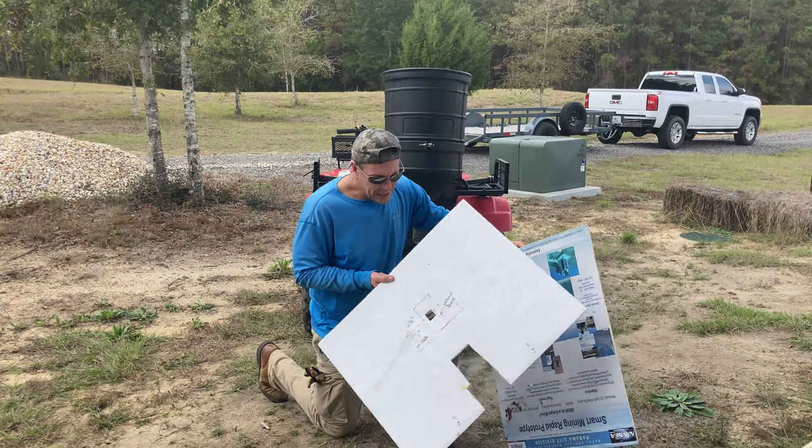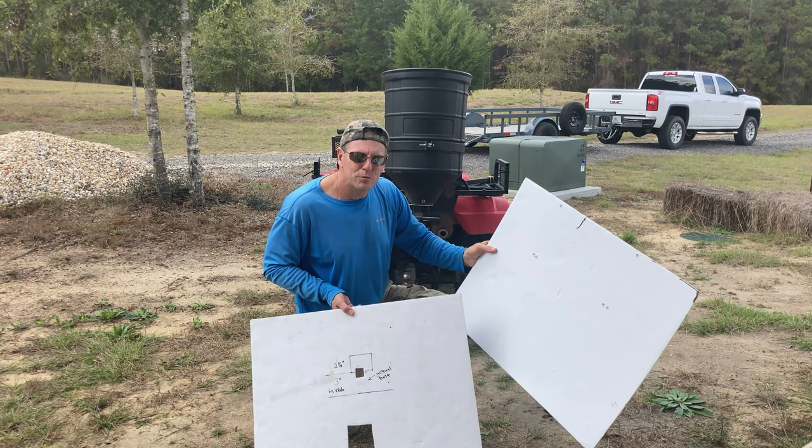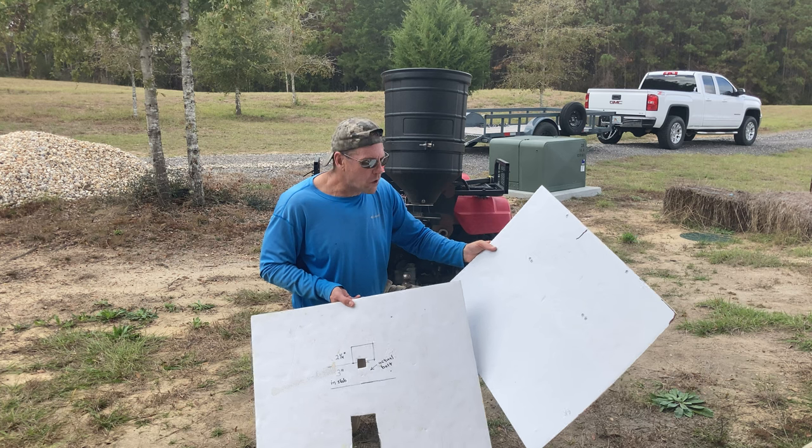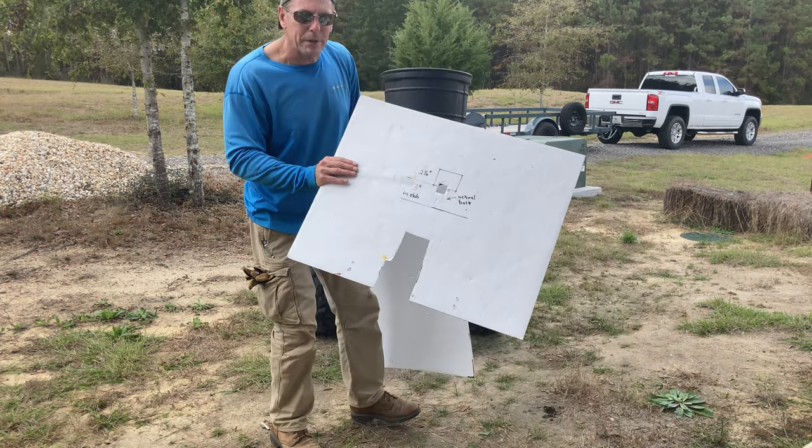So in the back, the manufacturer made a very small deflector plate. But you're going to see where I took some foam board and made that deflector plate basically go up the whole side or the whole back of the spreader. So all fertilizer is deflected back into the plot and not forward onto me on the ATV. So I'm going to show you what that looks like now. So like I said, I just cut some foam board out, and it's just some standard foam board. This is left over from some presentation posters at my work, but you can buy this stuff cheap in Walmart. That's very good stuff, and it's good for this purpose.